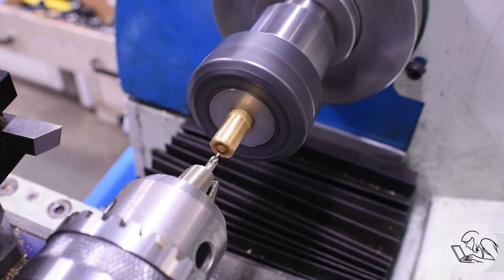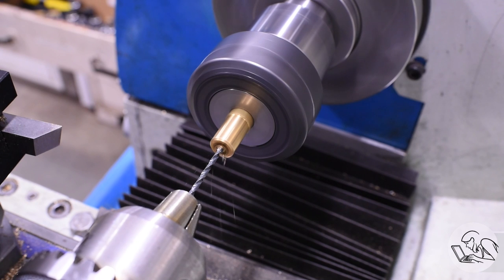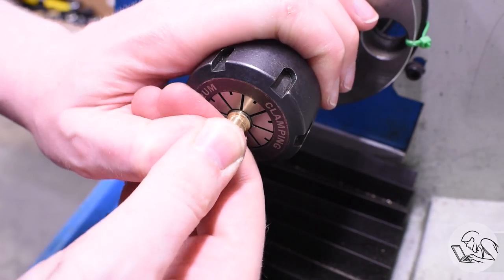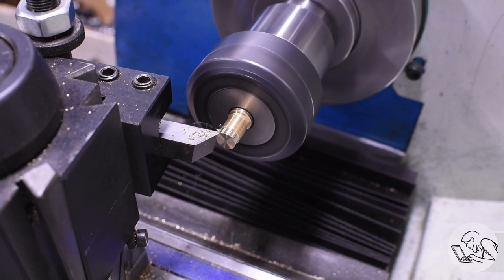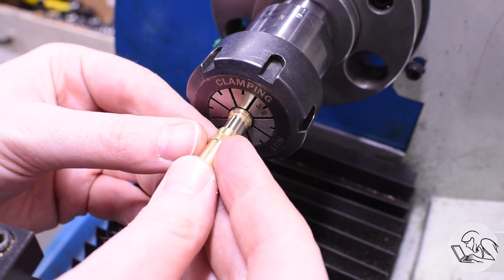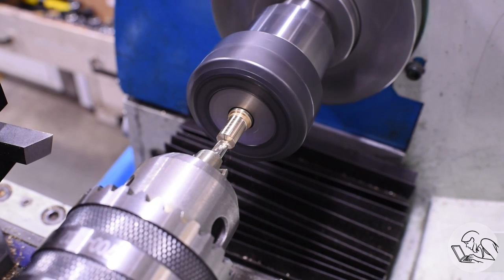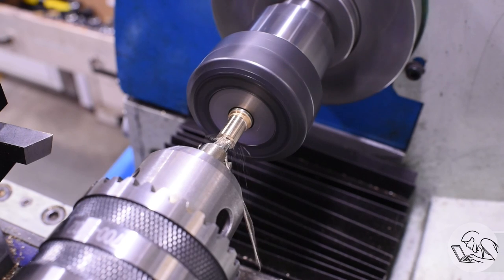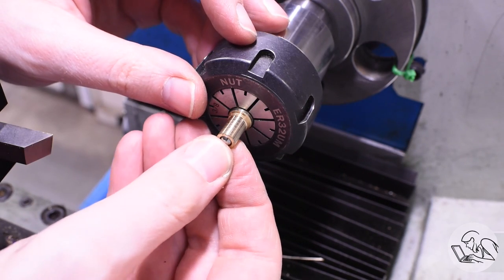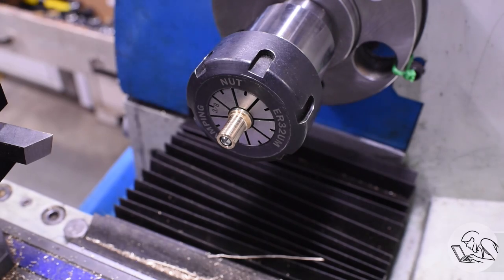A little magnification to ensure I've got a good clean chamfer all the way around for the ball to seal against — that looks like it's going to work. Now I've got the cover in the lathe and I'm drilling a hole in the center where there currently isn't one. This is going to be a guide hole for a pin and ball carrier that I'm going to add in there. The reason that this valve doesn't close cleanly is that it doesn't have anything directing the ball back onto the seat properly — it's just floating in there on the spring. So I'm turning this piece of brass to be a close fit in the cover to make a ball carrier out of it. This is straight from Kozo-san's designs for these valves.